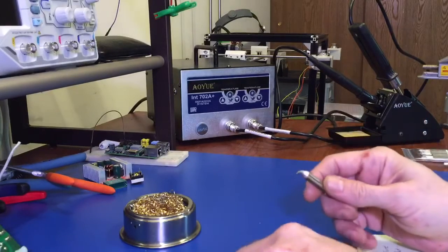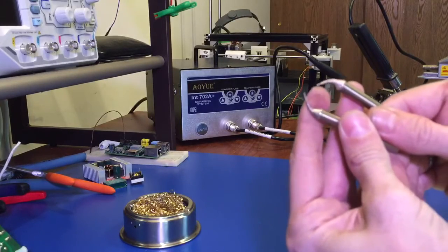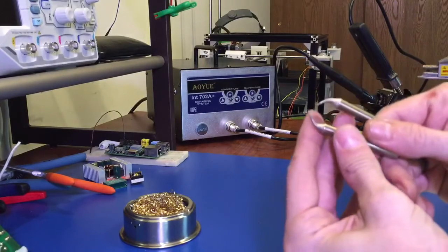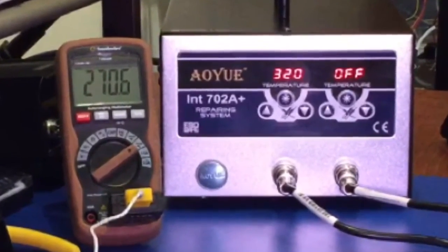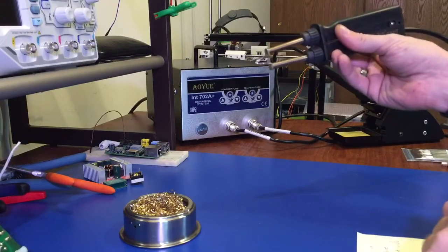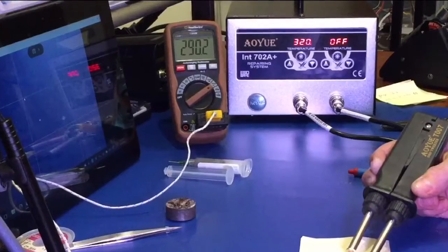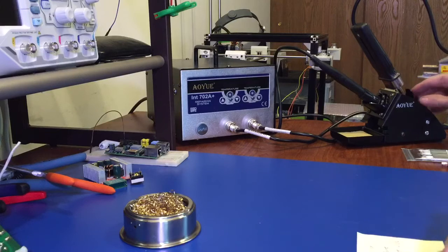You really don't need a lot more heat transfer if you're using a low-melt soldering paste and doing surface work. The pointy tweezers, when I tested them, only got to about 270 degrees Celsius when set to 320. The flat-head soldering tweezer tips that are currently installed would also reach 270 degrees with the unit set to 320 degrees Celsius. And again, for surface mounting work that's more than enough heat.